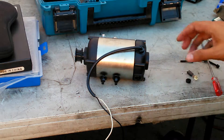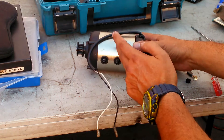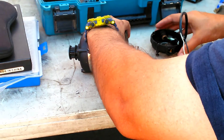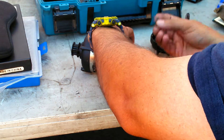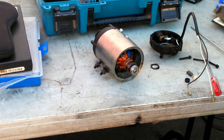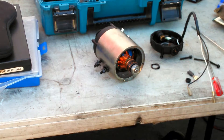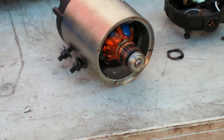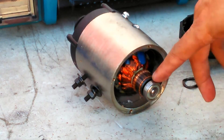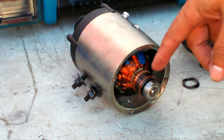So now I've got this guy out of here. There are only two brushes on this motor. Now I'm just going to pull the stator out. There's a wavy washer - actually two wavy washers on the end that hold the bearing against the motor. You can see it's kind of gunked up. I wanted to eliminate the possibility of any shorting due to graphite buildup. Those brushes have had a lot of use - I've used this lathe an awful lot.